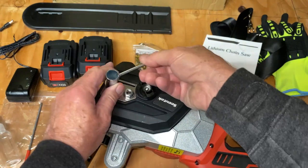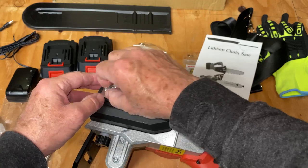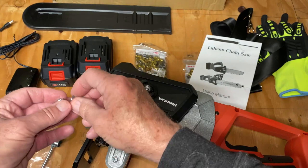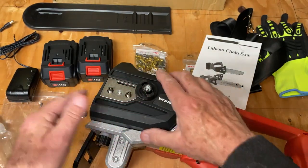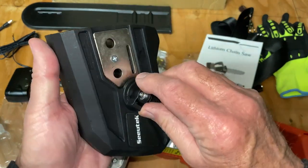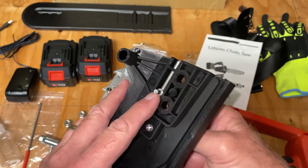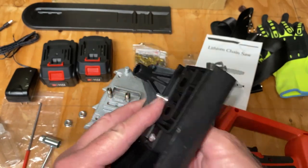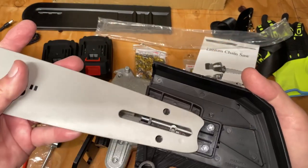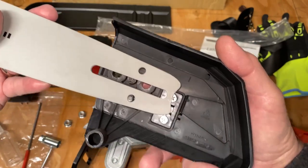Use this wrench to take the cover off. There's been a lot of confusion — the instructions that came with mine were for the old chain tightening system, but they've updated it with a better system. Hopefully they've updated the instructions by now. It used to have a screw in the front to adjust it, but now they've got this knob with a gearbox that runs a pin back and forth on a screw. When assembling, the saw needs to be laying on its side so that pin will hang straight down and drop into this hole.